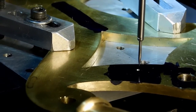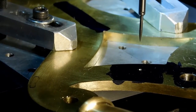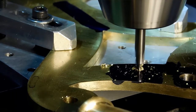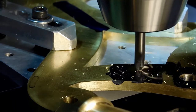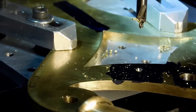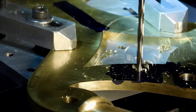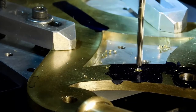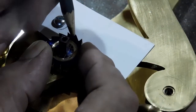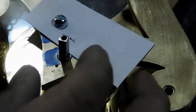This doesn't have to be very precise, but I worked out a position that I thought was the best place for the click screw. We need to get the hole tapped and a screw made before we can actually make the click, so that we can make a scale drawing of what we're thinking for the click. I'm tapping the hole here now and just putting a screw in there to hold it and put the ratchet on there.